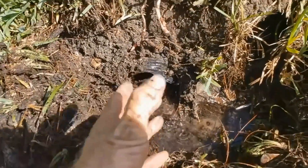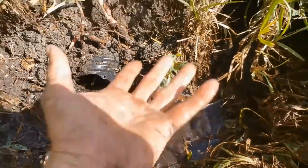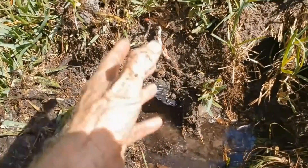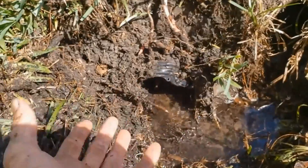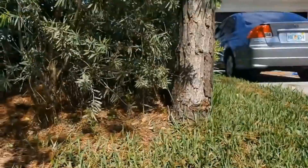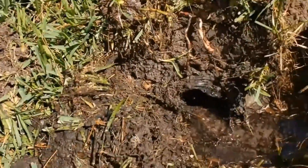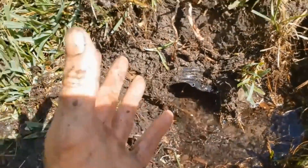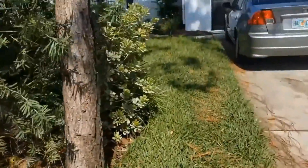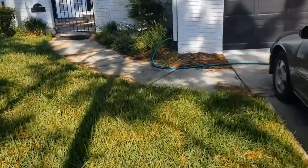You can see there's the end of the line — we've got a real good flow coming out. It's going into the culvert and getting carried away. But they buried it really deep and didn't put any pop-up on it, which is okay. But this has to be maintained — you can see the root systems. These are pine trees and they've got a huge root system that extends all the way and definitely seeks that water. A real simple thing: stick the garden hose in that downspout, just like up there. Stick the garden hose in it — if it overflows, you need to clean that line.